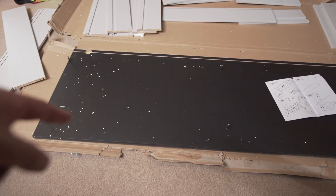You learn as you go - I forgot to put the shelf bottom in first. Once you get the first one done and figure out how to do it, the other ones are really easy. You just repeat this six times and it gets easier each time. Slip the shelf bottom in, then put the top piece on and tighten the clamps on the side. Now all that's left is to toss these drawers onto the rails, slide them all the way to the front, and screw in the sides - and that lines up perfectly.